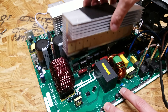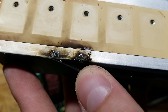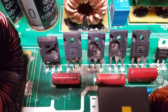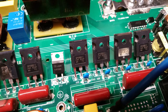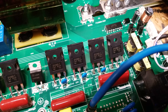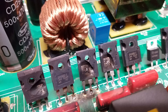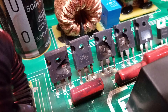With those all loosened, it looks like they have a temperature sensor on here too, which is pretty cool. And you can see here where the short circuit actually melted the heat sink — there is quite a big chunk melted out here and here. That's pretty incredible, that must have been a lot of power. All of the other components in here appear visually good, so I'm going to replace all nine of these transistors regardless of some of them looking good, because I don't know what damage the others may have suffered. And this is why you do not backfeed these inverters — they are not grid-tie, they are not meant to be connected to the grid. This was an honest mistake, and the person who owned this was actually an electrician. This is why you definitely need to label your breakers and put the proper interlocks in place.